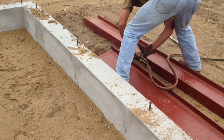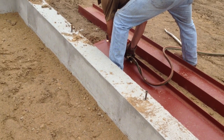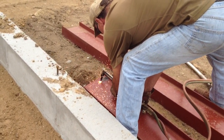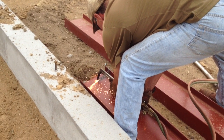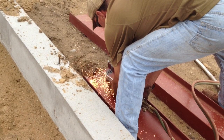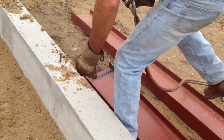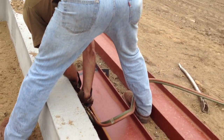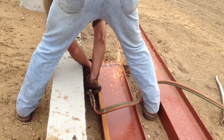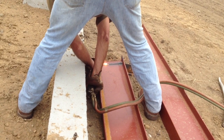Now that I showed you how to measure it correctly, this beam here is going to show you what happens when you don't measure it correctly. I screwed up my measurements — I assumed off my drawings that my beam pockets were 6 inches when they were all 4 inch. I measured wall to wall, just did the math, added in the beam pocket, and got 2 inches longer than I needed. So he's taken a 2 inch section off of 3 of the beams. The other two that span down the middle and don't bear on anything on the walls are fine.